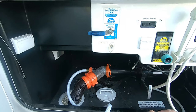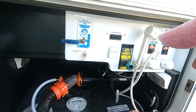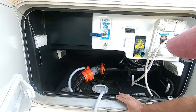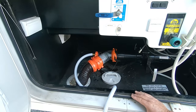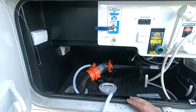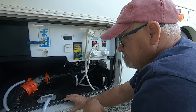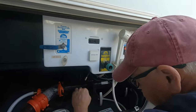As you can see it's coming back out — it's shooting up in there and hitting around inside my tank and cleaning those walls because you've got a lot of high pressure water shooting up in there and it's going to flush all that out. I'm going to keep doing that until I see clear water. It looks pretty clear — I'm not seeing any other stuff come out. Once that stops running, I'm going to do my gray tank, and then after that I'm going to use an RV toilet wand. I'm going to close my black tank and open my gray tank.